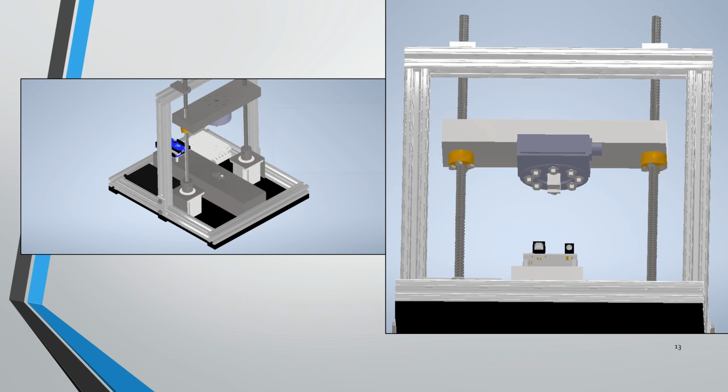And from here, you can see the clamping system that we have in place. We have these clamps up here, and then we have a clamp down here. The same clamp, but in different locations. Basically this is a threaded piece, and what we're able to do is take this piece out, and we could put in a Brinell hardness tester, and we can use this machine in compression as well as tension.